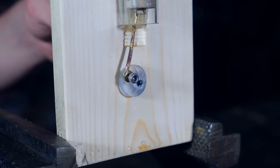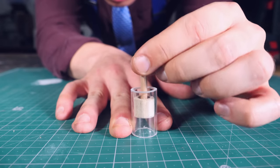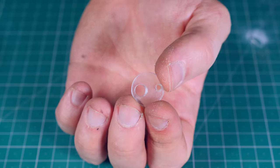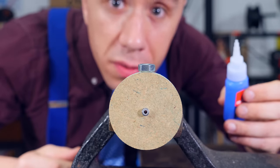It uses your standard crankshaft mechanism. The piston was cut by hand using a Dremel — that was tricky. It took a few tries until it fits snugly inside the cylinder, which is just a piece of acrylic tubing I cut to length. The connecting rod is a bit of brass tubing, the crank is a disc I cut out of acrylic, and the flywheel is a round chunk of MDF with nuts superglued to it. Superglue is useful.